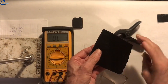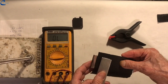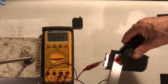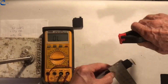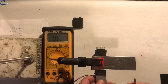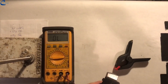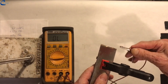This is another sheet with a thickness of only 0.2 mm. This is the electrode I tested in the hypochlorite aluminum battery, and its resistance is 10.2 ohms. Now a comparison with a commercial product — the graphite brush of an electric motor — which measures about 17 ohms.